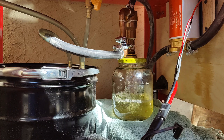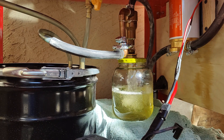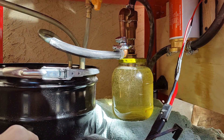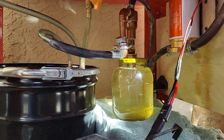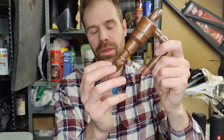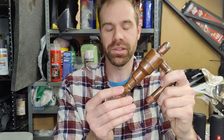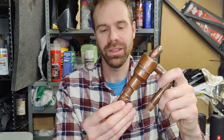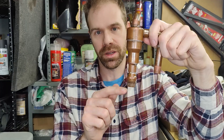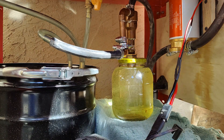You might wonder how the heavy stuff comes out the bottom - gravity separation is an important component of how this particular one is set up. The fluid comes in, spins around, the lighter stuff exits the top, and the heavier stuff literally falls by gravity out the bottom. On the bottom I have a threaded base connected to a pickle jar, which is a sealed container. It's sealed because the only flow you want through that section is the weight of heavier particles falling down and whatever it displaces coming back up.